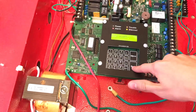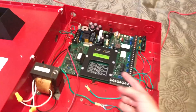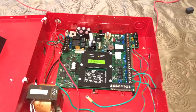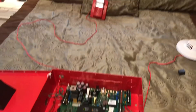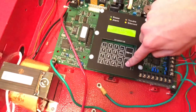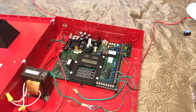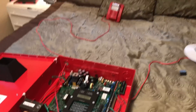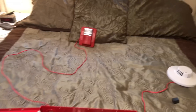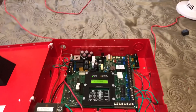One interesting thing is that when you press the reset button, the sync module resets before the panel resets — before the panel cuts power to the NACs, the notification appliance circuits, the fire alarms. That basically means the fire alarm will actually turn back on for a round before the system resets. We'll go ahead and do that and see that happen. Oh, maybe not — that is the first time it hasn't done that. I've tested this like 20 times before and all 20 times it's done that, but I don't know why it didn't do it this time.